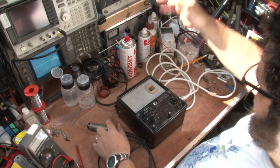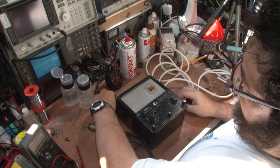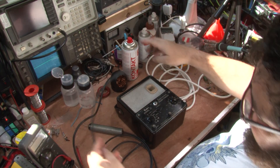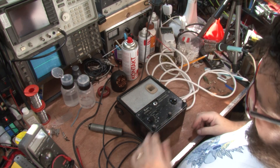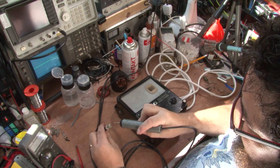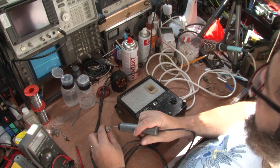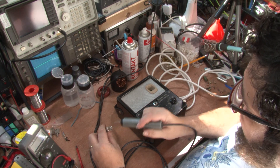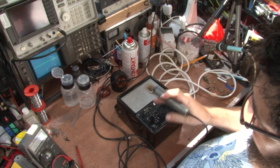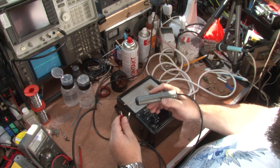What I've got going on the bench over this side is my audio generator and my RF generator. Now at the moment we're in RF mode. So the thing for me to do would be to turn it up. And yes — it picks up an RF signal. Now the thing with this is the RF trace position is also the audio position if you're using the probe. I've just set the audio generator to a lower tone so that you can differentiate between RF and AF.